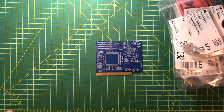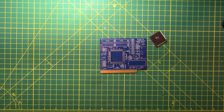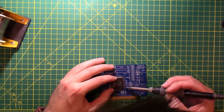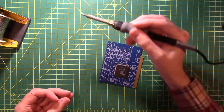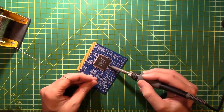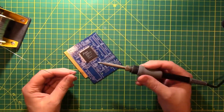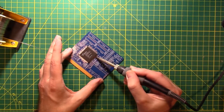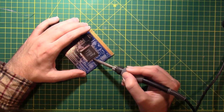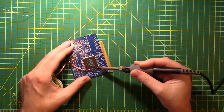Every project starts with a big mess of parts and this project was no exception. All this stuff was pretty easy to do except for this VGA chip here — there's a whole lot of pins. I'm going to put down some flux with my flux pen, tack down one corner, make sure everything's good. Then let's just start spreading the love. The goal here is to get just enough solder on, relying on surface tension, fluid dynamics, solder mask, and chemistry — all kinds of stuff that's way above my knowledge level. I'll do a little cleanup with the soldering iron itself and then get out some 30-year-old solder wick.